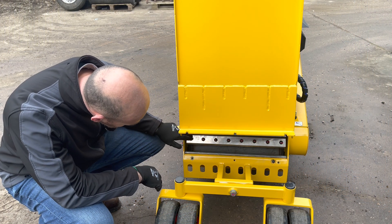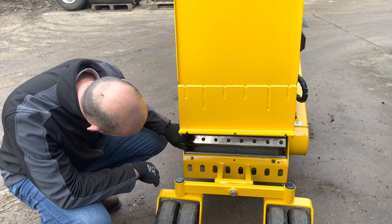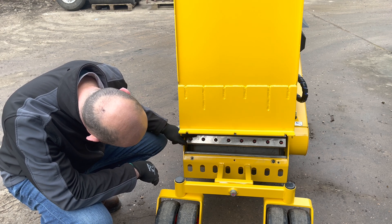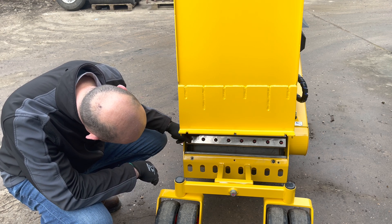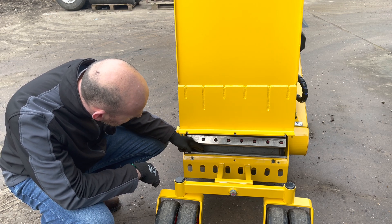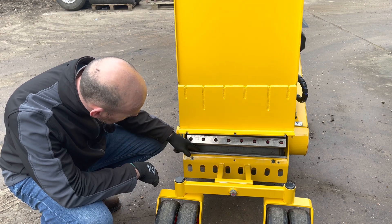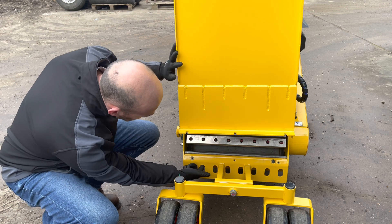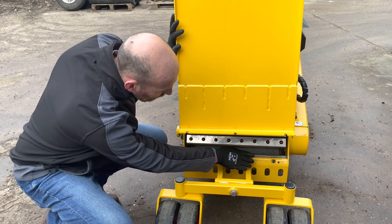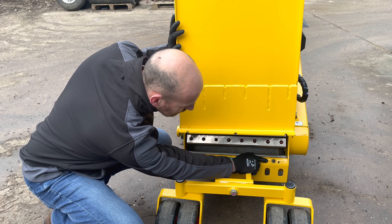The cutting drum is fitted with two knives, 180 degrees apart. You've got the cutting edge on this knife, and once this side's worn down, you can unbolt the knife, turn it round, and then you've got another cutting edge. These knives cut up against an anvil blade. The anvil blade can be turned four times as well, and to adjust it you have a set of bolts underneath through these holes, which allows you to move the anvil blade in and out. Over here we have a safety switch, so while the hopper is up in the air, the engine can't be started.